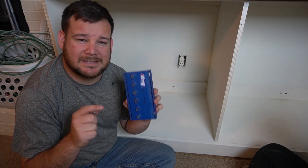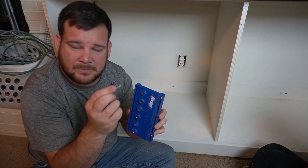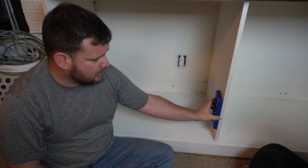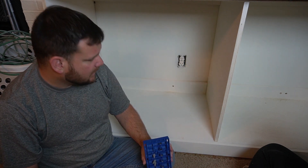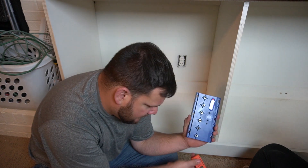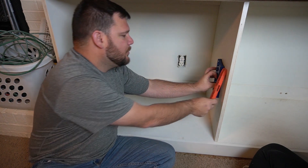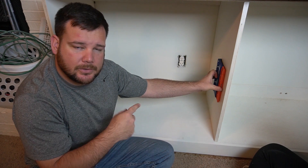We're going to add the pin holes for the adjustable shelves. I've got a tool that makes this super easy — this is the Kreg shelf pin jig. It makes it really easy to get the spacing correct. This jig has a piece of plastic that registers on the edge to keep everything parallel and you can just move it up. Since our doors don't come to the front, our holes need to be further back. So we're using a combination of this jig with a level — put it on, then put the level on to make sure we're level.